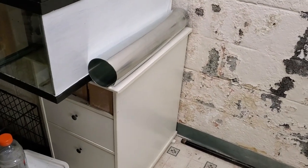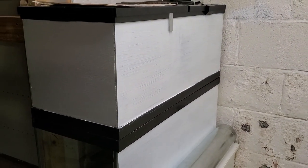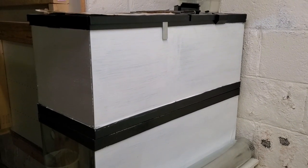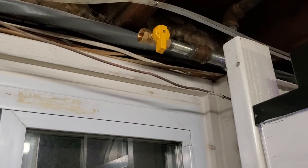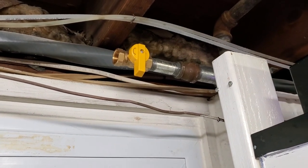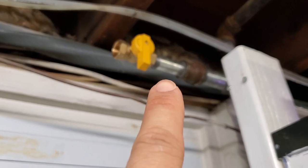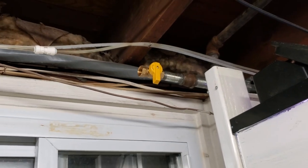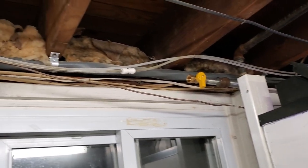Here is where the washer and dryer is going to be — this area will be completely cleared out. Right now there's an empty tank with miscellaneous supplies, and in here I have mice and rats together because I have a female on mice that I need to switch over to rats — I'm scenting the rats with mouse smell so hopefully she'll prey on them. Up here you can see the beginning of the gas pipe that's been moved over. I tapped an existing three-quarter inch gas pipe, ran it all the way over here, with a reducer going down to half inch and then a closed valve. That took quite a few hours — longer than I anticipated.